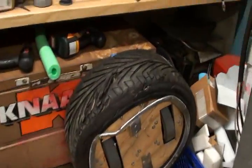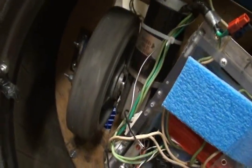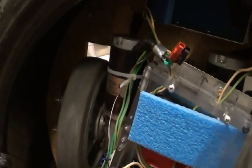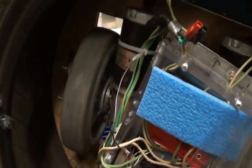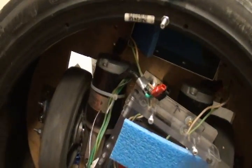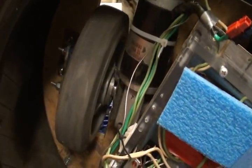Then let's take a look at TireBot — I don't think we've ever seen inside TireBot before, so I'll spin it around. Inside TireBot is a surplus Stature Electric Bruno wheelchair lift motor from Surplus Center, mated to an 8-inch NPC Colson knockoff. Running at 6S, about 20 volts, so we're getting around 400 to 600 RPM. On 8-inch wheels I think it's a little bit too fast — the torque would be better served otherwise. There's a second set of wheels on the lid — some 5-inch Colsons — that make contact with the top of the tire and allow it to run upside down.